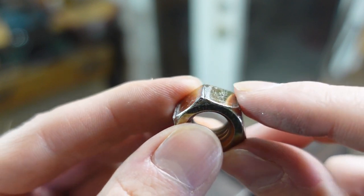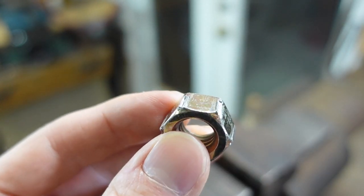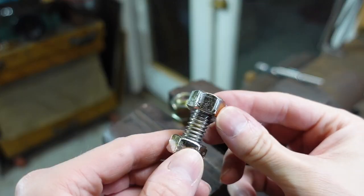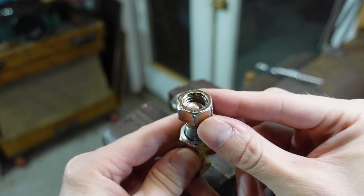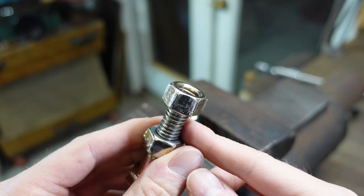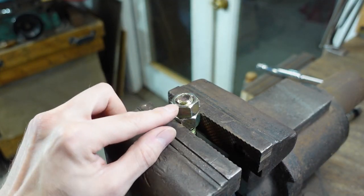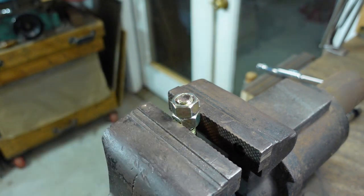But it's the nut that's starting to fail — it's tearing the nut. So I swapped out the nut and went for 150, but it was tearing up these nuts a little bit too much, just ripping off the corners. These are 3/8" grade 8 bolts, and it maxed out at 140 foot-pounds on these. Now I'm going to switch out to these 1/2" grade 8 nuts.